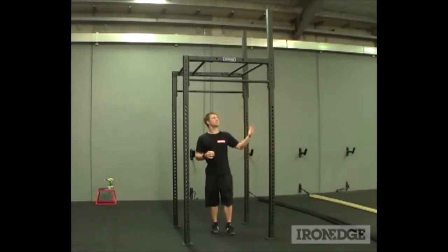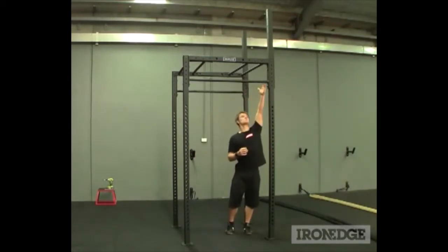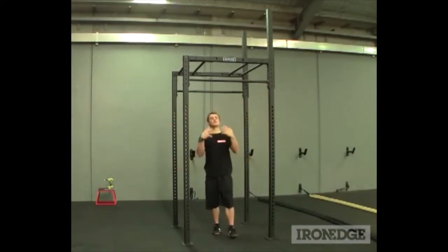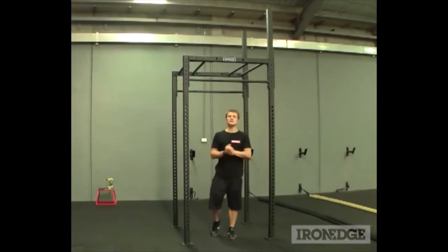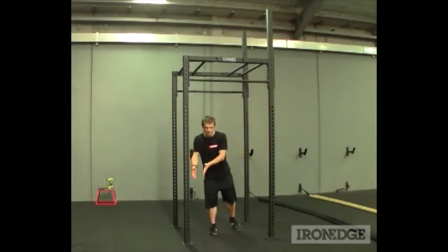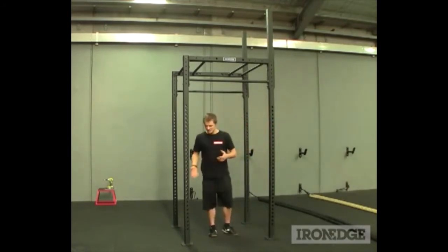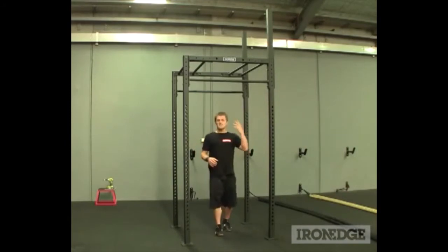Now, if you're extending on via the bridge extensions at the top, you want to build the complete structure first before you start to think about dynabolting to the ground. The last thing you want is dynabolting at this end, and then you're trying to line everything up, and you're just going to end up having to cut those dynabolts out of the ground. So naturally, build the whole structure, then dynabolt to the ground once you've done that.